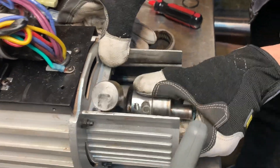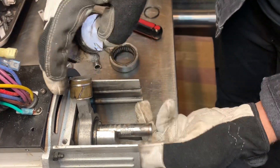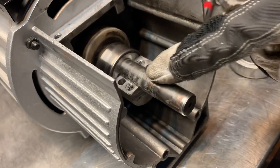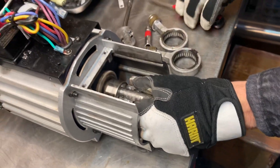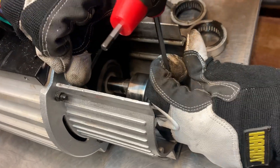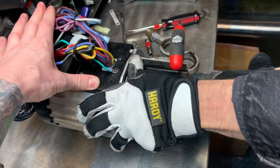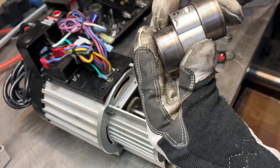Slide the cam lobe off — there are two halves to it. The first half comes out, then you can take out the second piston, and then slide out the second cam half. You'll see there's threadlocker residue on the shaft that makes it harder to slide off. You can use a flat head with a spacer to push it back, or if it's really stuck, stick something thin through and pull both sides. Be careful not to overdo it on the threadlocker when reassembling.